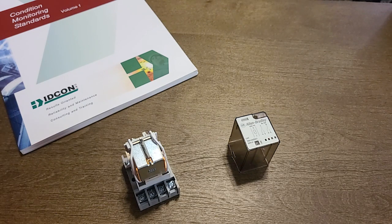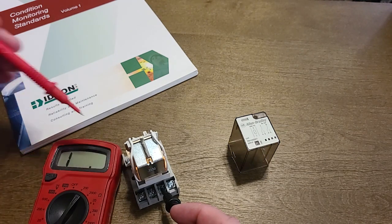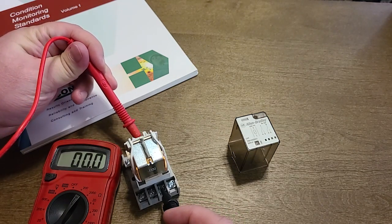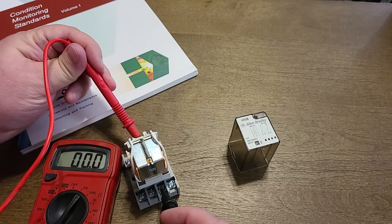Now typically you'll need a multimeter to check continuity between the normally open and normally closed terminals. For instance we have terminals 1 and 4, which is normally closed. If we test this by putting the leads on 1 and 4, we'll watch as the ohm reading goes down to 0, meaning there is no resistance — or barely any resistance in reality — between these two points because the contact is closed.